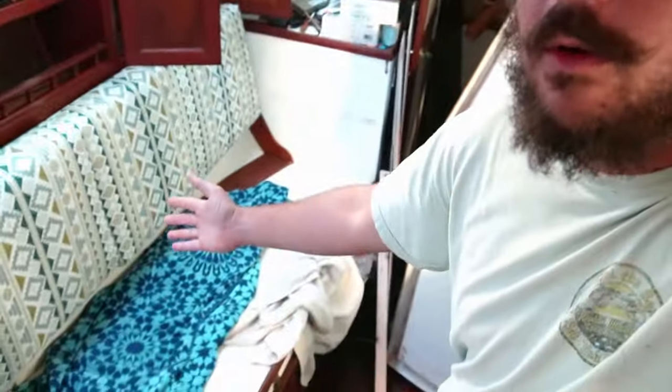I'm feeling a little overwhelmed right now because we've got so many projects going on on the boat. With the new cushions in the boat, I have to go around and make sure that all the leaks are taken care of before any of them get wet and damp and moldy. So the water's coming in through this chain plate fitting. And if I'm going to go through the effort of replacing the chain plate fitting and re-bedding it, I might as well just go ahead and pull the chain plate because I don't know how old those chain plates are. I have no record of them ever being replaced. They should be replaced every 10 to 25 years depending on the condition. I've gotten all but one of them exposed, and the last one I need to get to is behind some cabinetry. Because we're doing the beadboard project at the same time, I've decided to combine that project with the chain plate project right now.